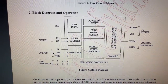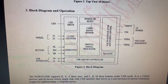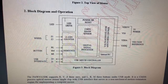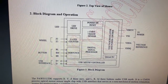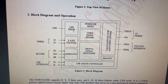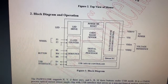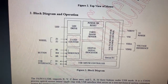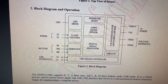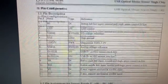And this is what it looks like inside. We are not using the image sensor portion, though I've left the hole open so the camera can see the bottom of the PCB. Here is the LED that synchronizes between the image sensor and the reflecting object. What we are interested in is the wheel encoder, the three buttons, and the USB interface — the rest is just power, etc.